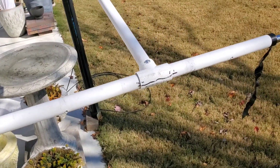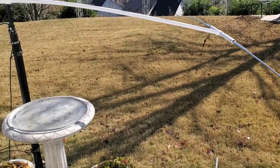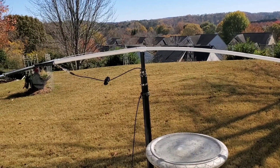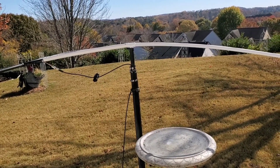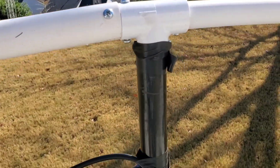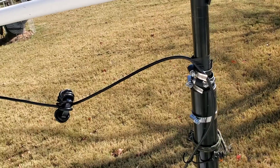The antenna balanced well - the modeling showed a significant amount of gain. Front-to-back was supposed to be about 12 to 15 dB. The PVC may not look centered but weight-wise it is balanced - the coax and ferrite core on the left counterbalance the PVC and antenna element on the right. The antenna goes up 16 feet high and hose clamps lock the spider beam sections so they don't collapse.